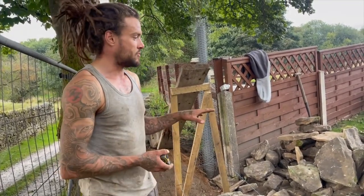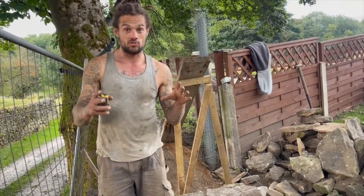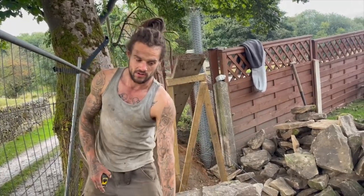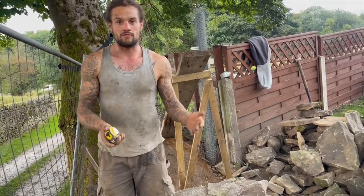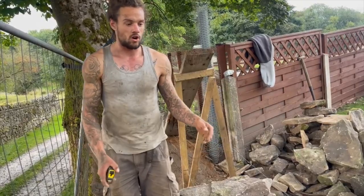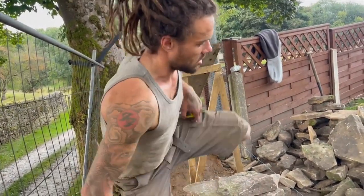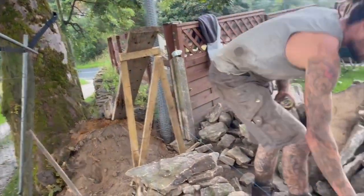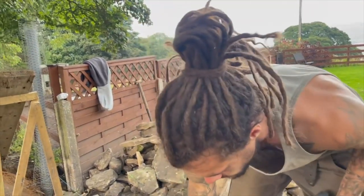The tricky bit, if you haven't done any walling before, is you want to try and get all your bigger, meatier stones in the base of the wall in that primary lift, because that adds stability, strength and rigidity to the finished form of the wall. If we were to start walling with some small stone,